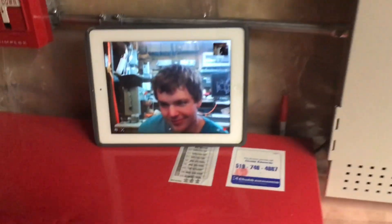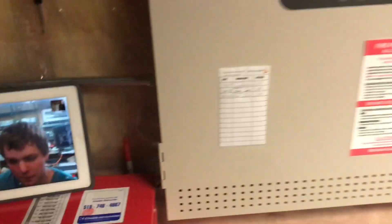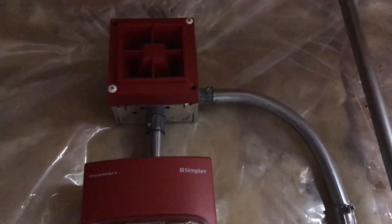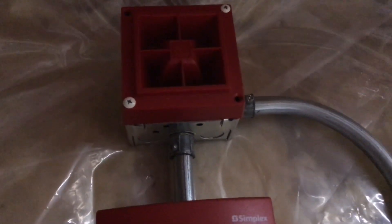So for this Minisystem Test, we are joined with Canadian Alarms. You can see we have some new devices here. For the Notification Appliance, I chose to go with my System Sensor Mass Sounder, and it is set on 2400Hz.